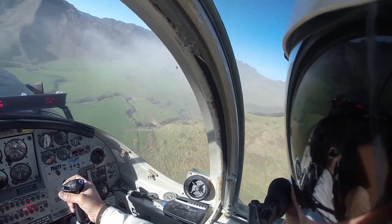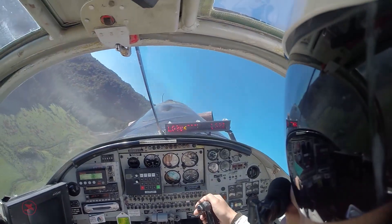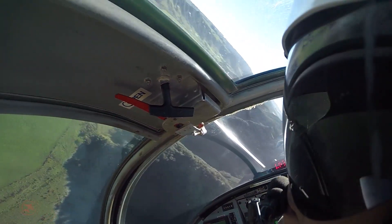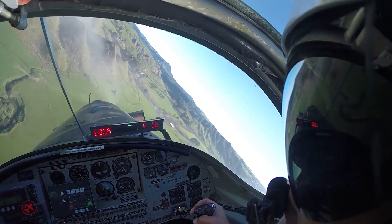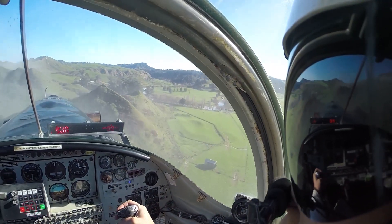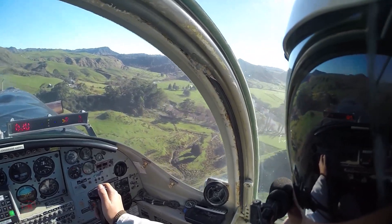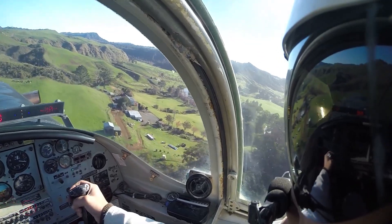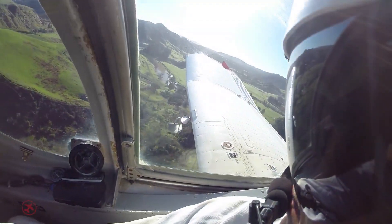Base of the hill is our end boundary. Close the doors, advance the GPS guidance to our next run and turn around to line up. Looking outside where we want to roll out and cross-checking with the light bar, adjusting just where necessary. This is our boundary — open our doors, blue lights on. Check the mirrors, she's flowing freely. Clear of the house but keep note for our next run.